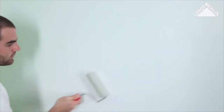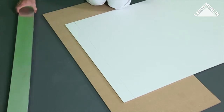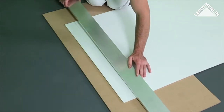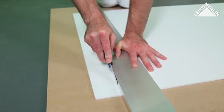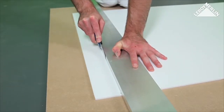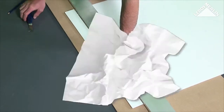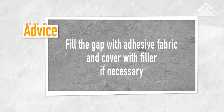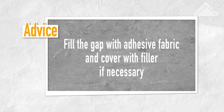Lift the two remaining strips carefully off the wall. Realign the two edges and smooth over the surface. Cut off the final pieces at floor level and at the ceiling with the retractable knife. If necessary, mark the wall top and bottom on the sheet, then cut off any excess insulation using the knife with the sheet sandwiched between a length of wood and the steel ruler.